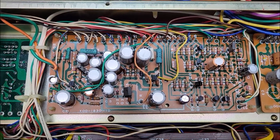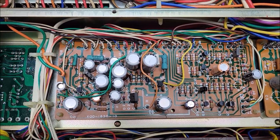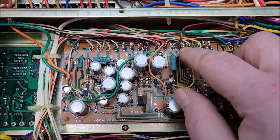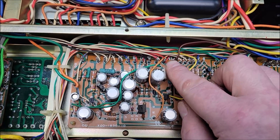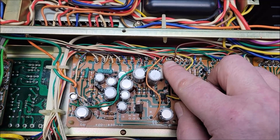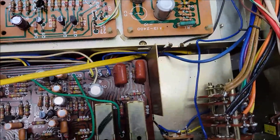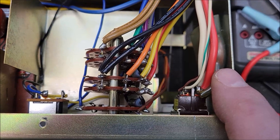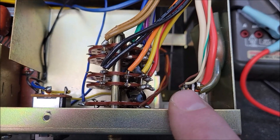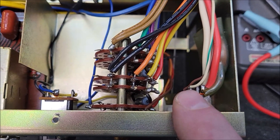Then I started digging around in here and I realized that the voltage on pin 13, which is right there, was approximately 0.7 volts. And it should be 0 volts, because it's supposed to be grounded. Over here on the power switch, you've got power on this side, and then you've got pin 13 there, and then ground. So when the power's on, that pin should be grounded.